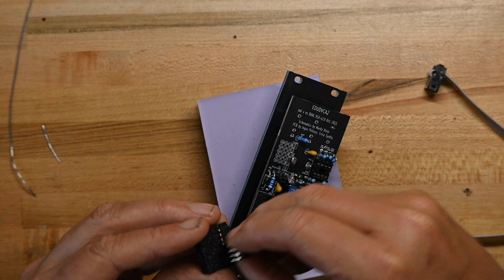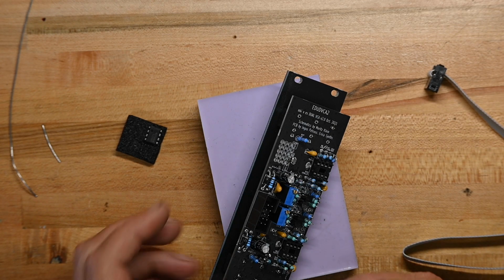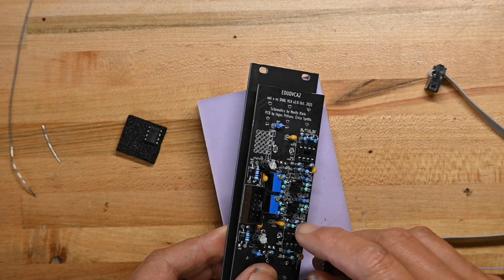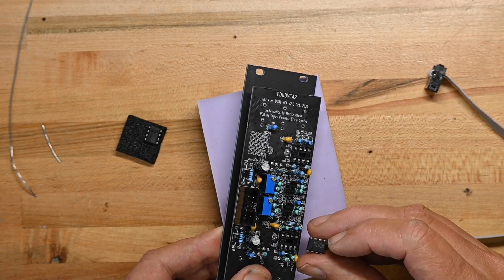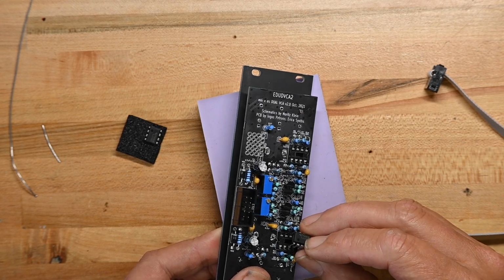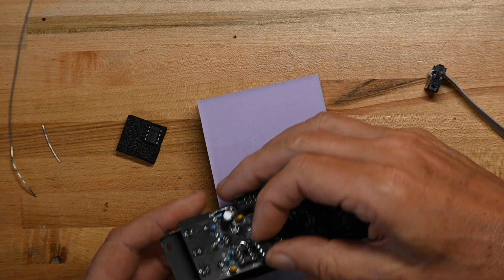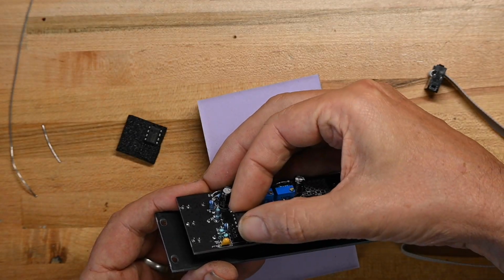two ICs, two dual op amps, which, as the name implies, are little amplifiers. Now the notch is there, and on these chips from TI they don't have a notch on the chip, they have a little dot that takes the place of the notch for orienting what you're trying to do.